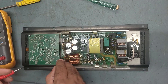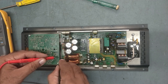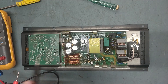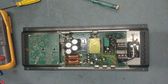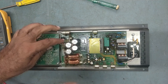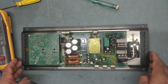This two is for HF and this two is for LF. If there is any shorting then there is a problem - but there is no shorting. Our amplifier section is good. So now we will concentrate on the input board. We will take out this one and disconnect the 10-pin input connector from the amplifier board to the input board.